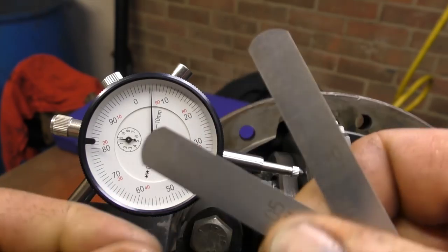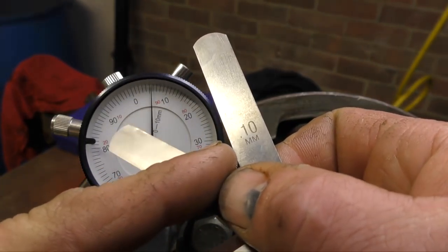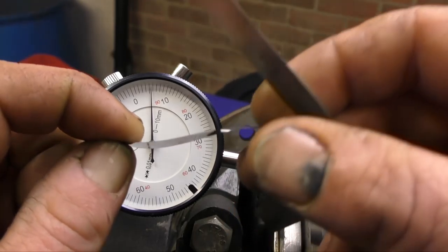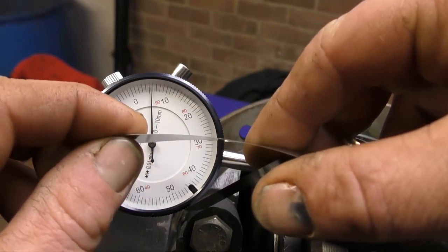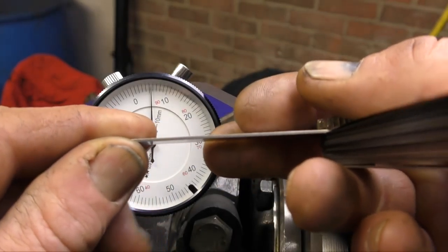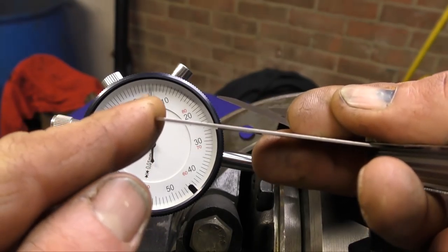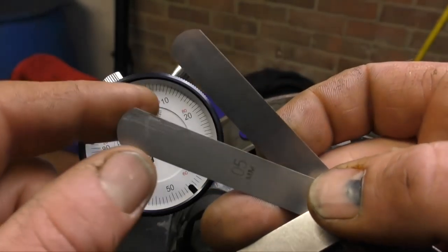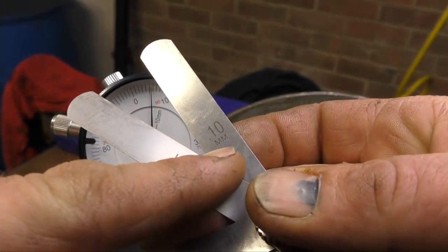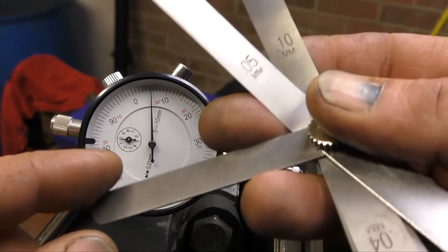I'll just find the feeler gauge equivalent of 0.05 of a millimetre. 0.1 of a millimetre is one-tenth of a mill. You can see that - 0.05 of a mill, very thin. And so is this, one-tenth of a millimetre, or 0.1 of a mill. Okay, this is one millimetre - it's a lot more substantial. So that is actually one complete revolution. The run-out is 0.05, maximum is 0.1. There isn't actually much in it, but it makes a hell of a difference with machinery that needs to go around at high speed.